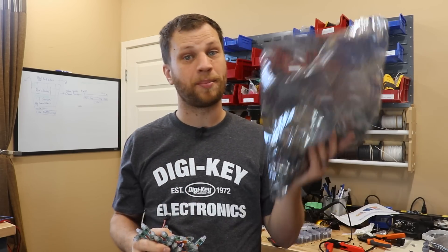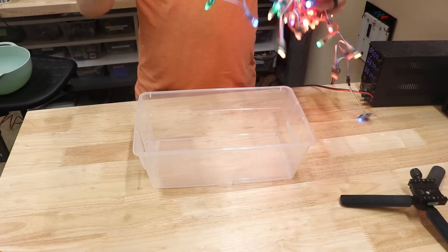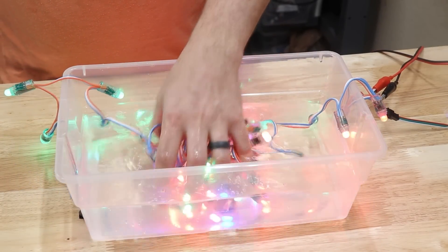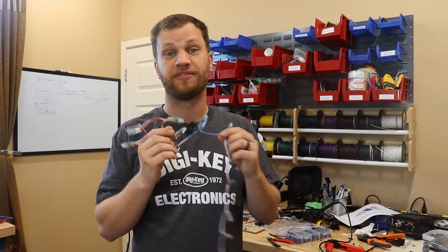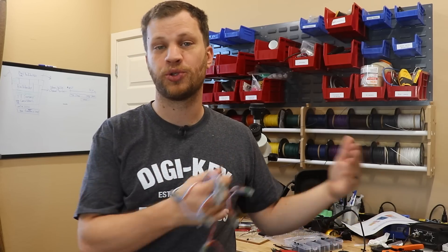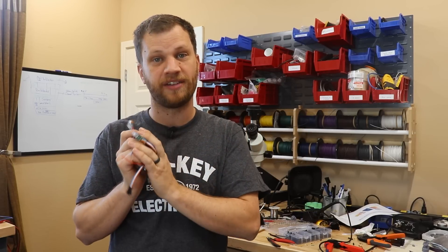For this project I'm not going to use an LED strip, but instead I'm going to use an LED string like this. You can buy these as individual strings, or I ended up buying a 10-pack for about $130. A 10-pack comes with 500 individual lights, which works out to about 26 cents per light. These LEDs are made for this application — they come encased in epoxy which gives them an IP68 rating. They come in two voltage types: 12 volt and 5 volt. Because my controller runs off of 5 volts, using a 5-volt string means I only need one power supply.